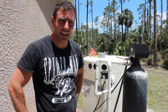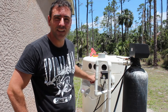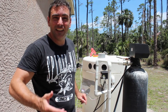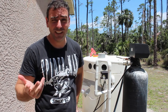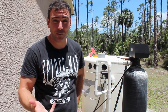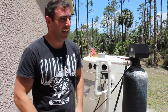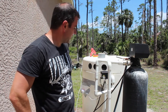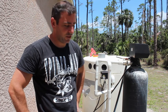I've had cases where the pump inside has come loose and is leaking water, so it never builds up pressure and runs constantly. The only way I'd know is if I paid attention and heard it running outside, or if the water inside the house got very hot — the pump runs so much it gets hot and comes out of the faucet almost scalding even on cold. That's happened twice in the seven or eight years I've lived here. Now hopefully I'll know right away when that starts happening.